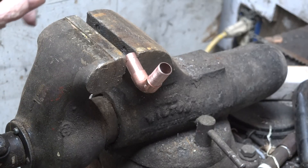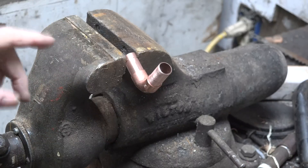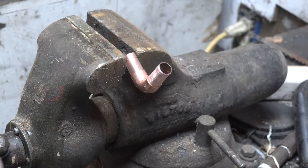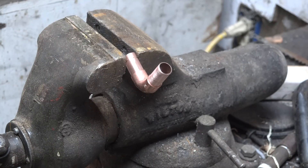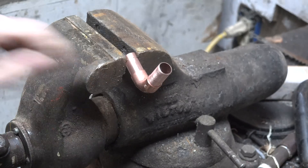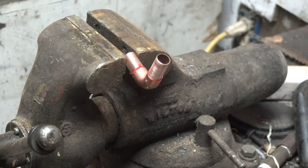And I'm done with the joint unless there's a defect in the fitting or something. So I'm going to demonstrate that, then cut this thing open and look at what it looks like inside. Then I'm going to do what's very common for folks just getting started — they don't think they've used enough, so they use too much. I'll do another one with too much solder, cut it apart, and we'll see what both look like inside. The joint's fluxed — I'm going to go ahead and do the solder job.